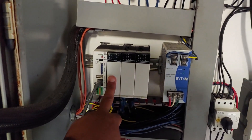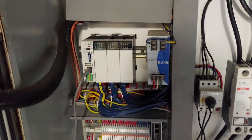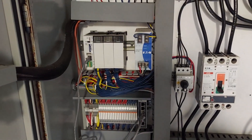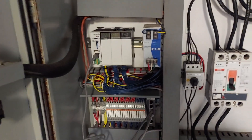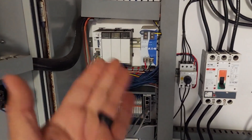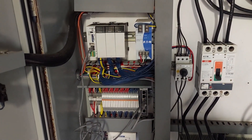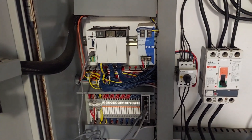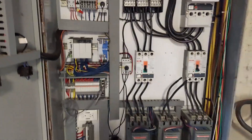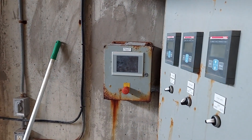If you don't know what PLC stands for, it's a Programmable Logic Controller. The PLC here controls the startup of the waves and also controls the pistons. It also takes the system's controls, and there's an e-stop — emergency stop — on it as well. Those are the yellow tags right there. Because I've got it in service mode, I'm not going to be able to turn it on. There's the control panel for it.